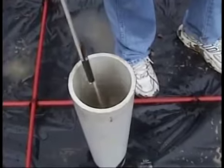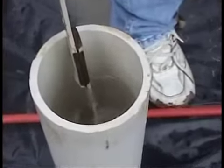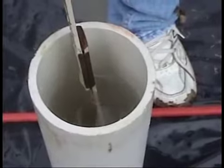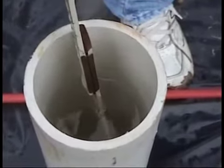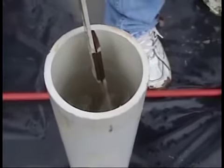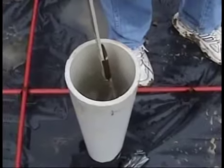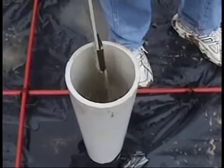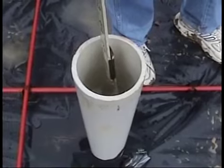As you can see, there's water inside this pipe. It goes all the way down here. And once again, the builder has to ensure there's a constant level here. Now, something else that's sometimes done is what we call burping the line, where we'll go to another plumbing protrusion where the cap has not been glued on. You pull it off, and it's what we call a burp, lets air out, and this should go down a little bit and just shows it's a closed system.